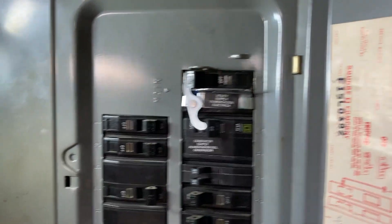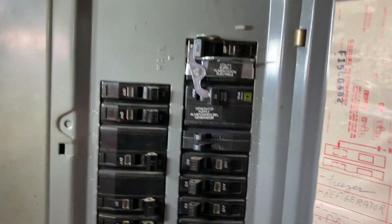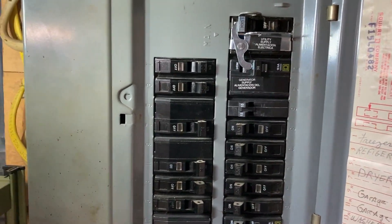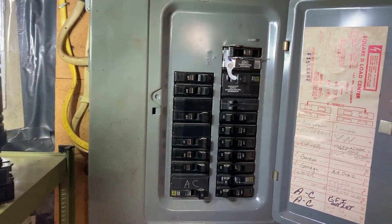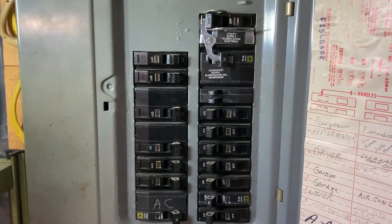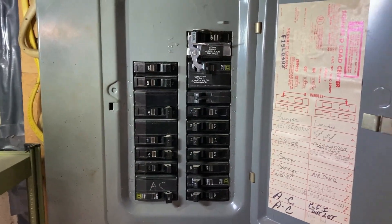I'm out about 60 bucks for the plug, the wire was about $20, this piggyback breaker was $12, the 30 amp breaker was $60, and the generator interconnect was $30 — so it still gets kind of expensive. Do your electric this way — don't build suicide plugs and plug them into your dryer outlet. If you screw up, you can back-feed 240 volts out from your house back to the transformer that steps 8,000 or 16,000 volts down to 240. Now it's stepping up, and a lineman out there fixing that line gets shocked with 10,000 volts. So spend a little money and do it right — linemen everywhere will thank you.